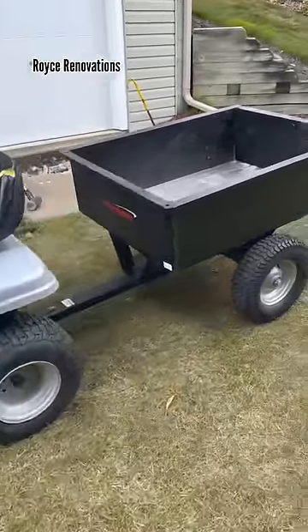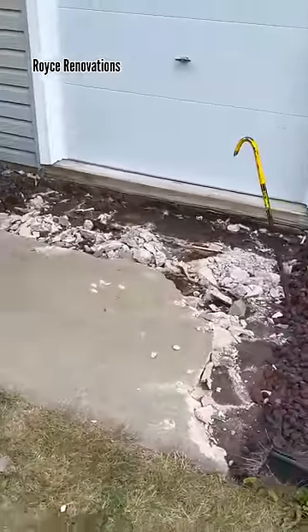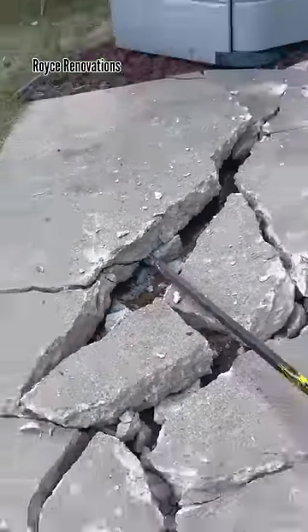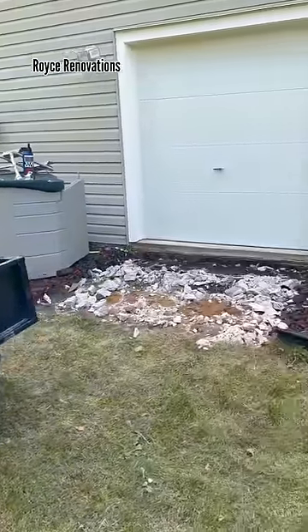It's pretty obvious why this concrete slab failed. The Craftsman does offer a couple horsepower, but that's not too significant here. You concrete guys probably know why it already failed — you can see the grounds were not prepped properly, and there's no rebar. So essentially, this thing was held together by hopes and dreams.